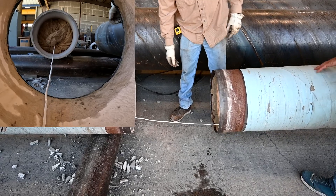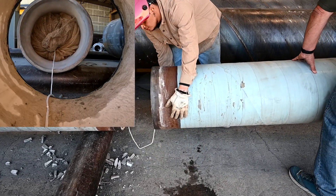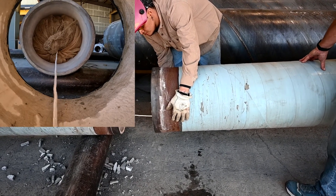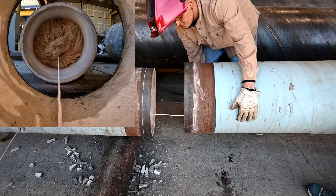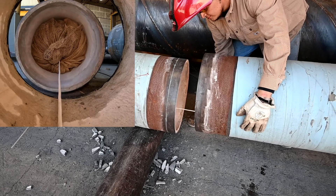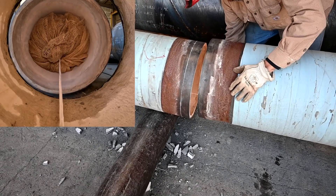We are ready now to fit the pipe together. When fitting joints of pipe together, you should be installing the pipe at an angle, then lowering it into place. Make sure that the wiping line is out of the way and begin to fit the pieces together. Make sure you fit the bell end of the pipe all the way to the previously marked line on the pipe. Remember, we are trying to make the smallest gap possible between the two joints of pipe.